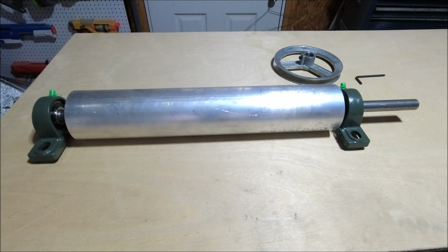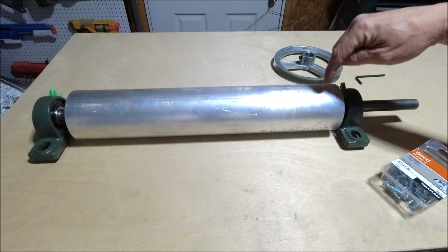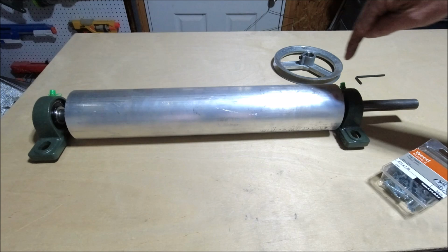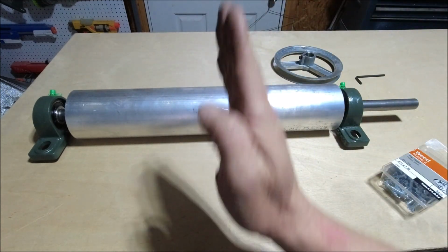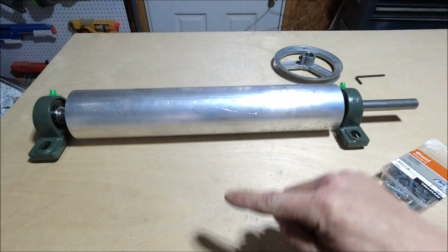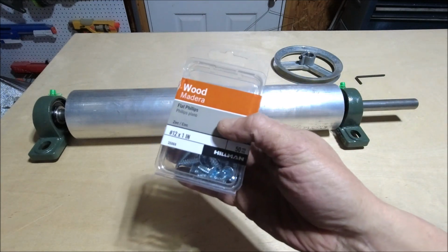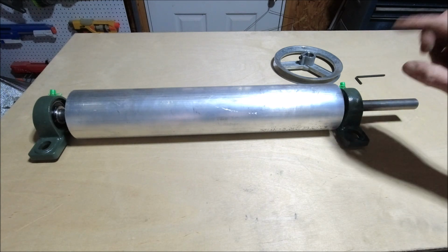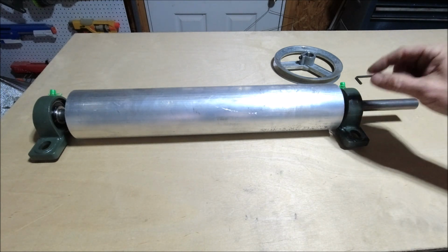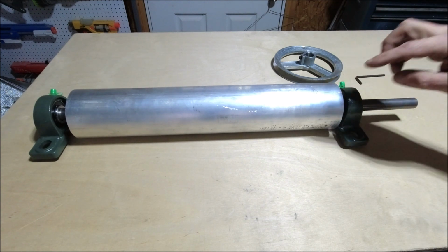What we're going to do is connect the 1.25 inch thick blocks to the drum. We're going to drill through the drum in a cross shape at the compass points, north, south, east, west, and countersink it and use 1-inch wood screws. These are number 12s, which won't hit the shaft. That's why I selected 1 inch. So we get 3/4 of an inch, even a little more after we countersink, because we don't want it interfering with our sandpaper.